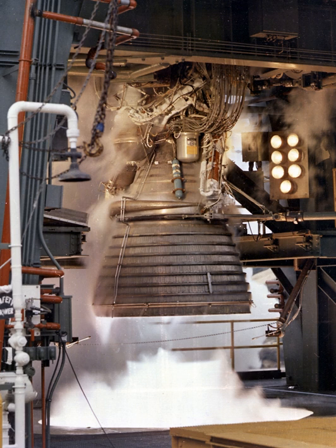The fuel and oxidizer flow meters were helical vaned, rotor-type flow meters located in the fuel and oxidizer high-pressure ducts. They measured propellant flow rates in the high-pressure propellant ducts. The four-vane rotor in the hydrogen system produced four electrical impulses per revolution and turned at approximately 3,700 rpm at nominal flow. The six-vane rotor in the LOX system produced six electrical impulses per revolution and turned at approximately 2,600 rpm at nominal flow.